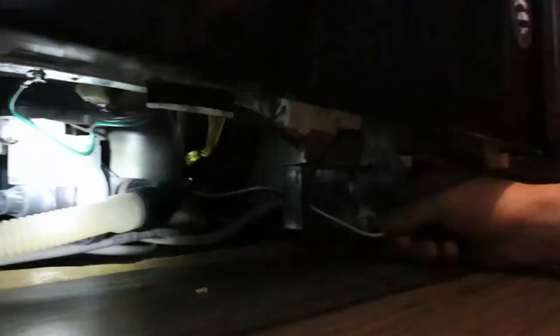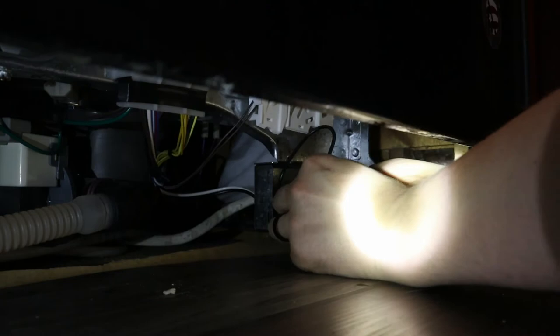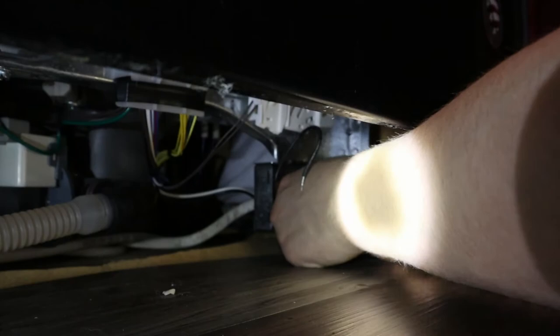Make sure you get your electrical back in. Your ground is going to go to your ground clip. You've got white to white, black to black. And if you don't have this ground clip, it's solid copper — it might be the green one. Tighten that ground down. White to white, black to black, and there you go — electrical is done.